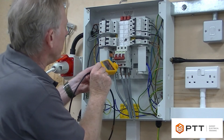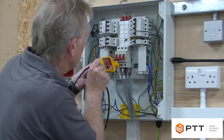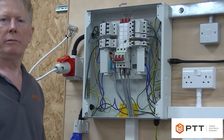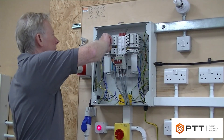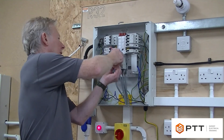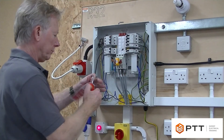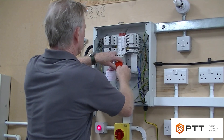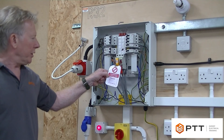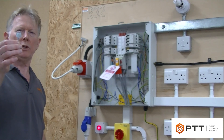I then need to reprove the unit. That's still functional, so now I can say that those circuits are in fact dead. I like to teach the mnemonic SOLO: Switch Off, Lock Off. So I switch it off, and now I lock off. You may want to put your details on there, like perhaps your mobile phone number in case you need to be contacted. It's very important to put the key on your person, as you are now the duty holder of the electrical system.